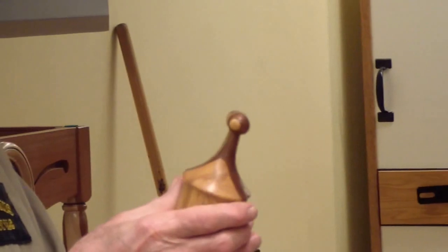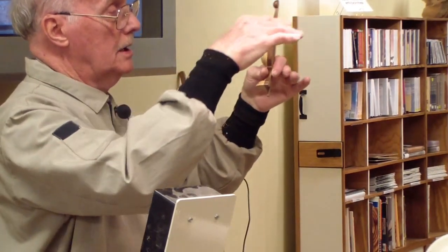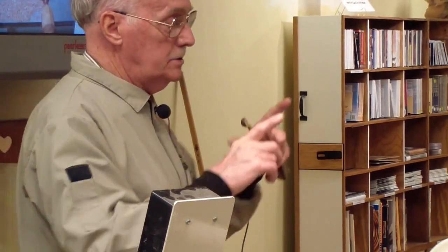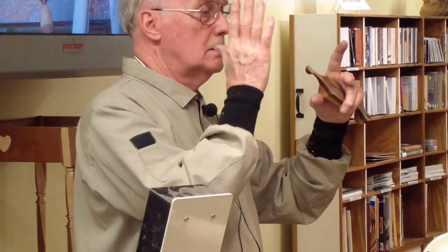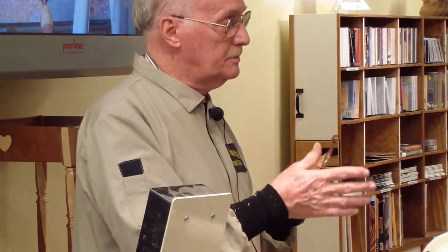But this actually came off my fireplace. The pillar goes up, and then it stops. And instead of doing some kind of a shelf up there, I took two pieces of wood, probably 3 inches by 6 inches, made a 6-inch circle, glued them together with the brown paper in between them. And then turned the edges, turned them flat, sanded them, put beads around the edge, then split them in half, and I had two half-round shells.